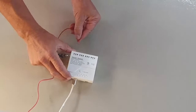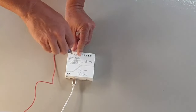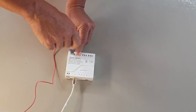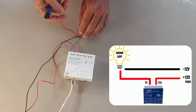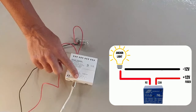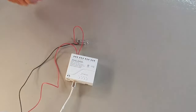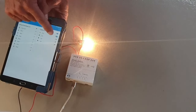Now, let's wire up a light to demonstrate the relay working. We connect the supply's positive voltage to the common central terminal, labelled COM. And the positive from the light goes to NO, normally open. Let's test the physical switch — it works. And now, let's test the virtual switch via Home Assistant. And it works as well. That was so easy!